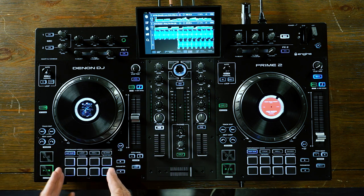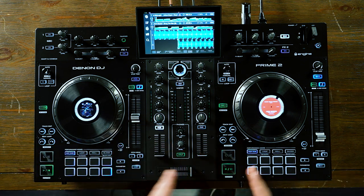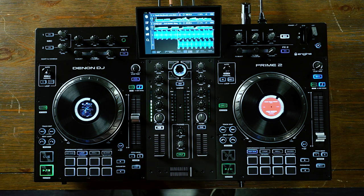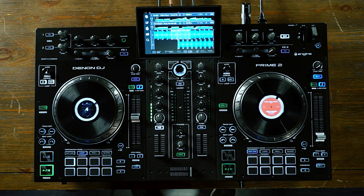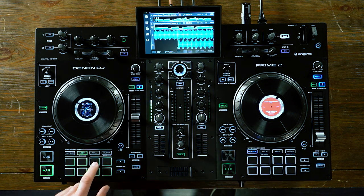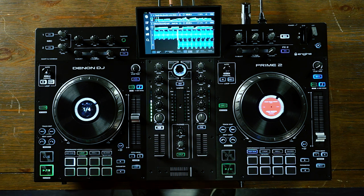In the center bottom of the unit, we have our performance pads with multiple different features. Hot cue gives you eight hot cues where you can set different points to jump to in the track. From hot cue, we have loop mode. On the first layer of loop mode, I'm able to quickly set and store eight different loops — done easily by hitting loop in and then loop out, which loops that section and saves it for future use so I can jump back to it anytime. Pressing loop again goes into the second layer, which provides preset loop lengths for quickly setting loop values on the fly — as I go down to the left, the loops get tighter and tighter.